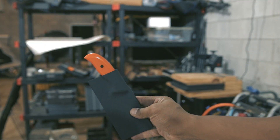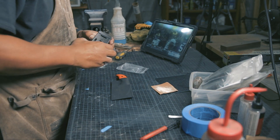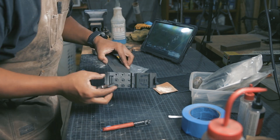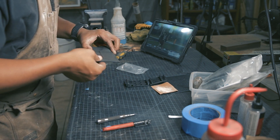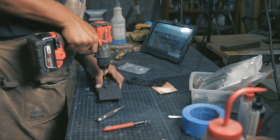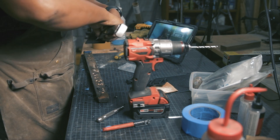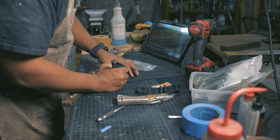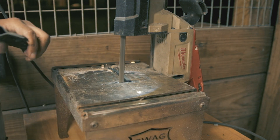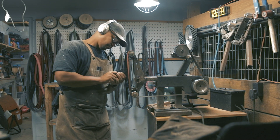If I'm completely honest, I just got tired of talking — this is actually the next day when I pulled that thing out of the press. We're going to go ahead and get started with getting the holes drilled, the rivets driven in, and the clip attached. If I'm completely honest, I filmed this back at the end of December and it is now the end of March and I'm just now finishing this edit. This is what happens — I get busy and forget to finish videos. But yeah, we're drilling quarter-inch holes, drawing out the relative shape of what I want, then cutting that out on the bandsaw. Once it's cut out we're going to go to the 2x72 to get it shaped up and get rid of some rough edges. I also use a Dremel tool to get all the curves right.